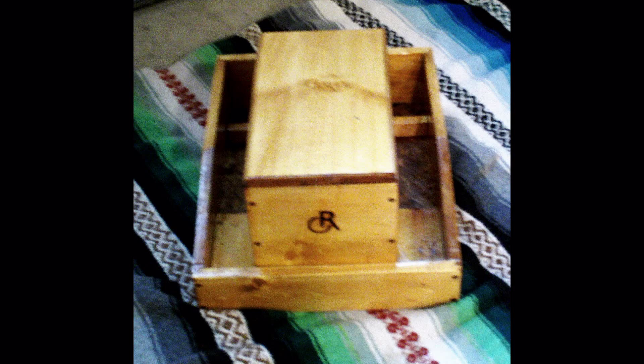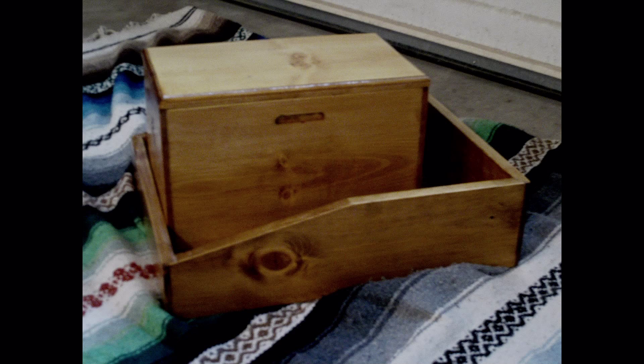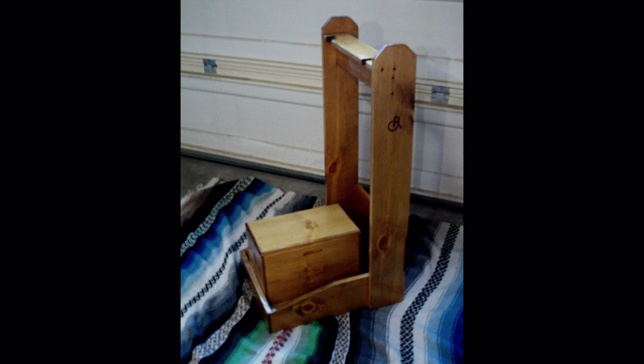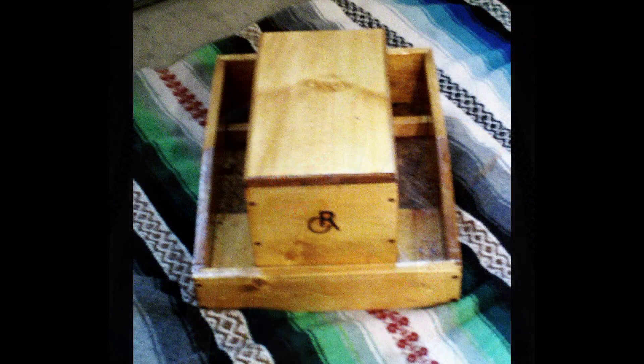Now it was time to take a few measurements, make some concept drawings, and construct a few patterns to work out the joints. In a vertical position, an average 1800s long gun needs eight inches of frontal space to allow for the comb drop. Thirty inches is needed for the forearm wood, and a width of two inches. I decided to build the bottom base and vertical gun rack out of one-by-six pine, which would allow for strength of all attachments. I found out how far into the bottom box the back of the rifle would sit and how much farther was needed for the front of the rifle, helping determine a minimum length of the bottom box. The forearm length and the cart handle height determined the height of the gun rack — keep in mind the added lift of the wheel diameter. Next, I checked the sizes of everything that was going to be carried in the storage box, which would determine the minimum width of the base.